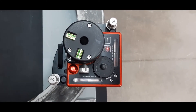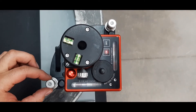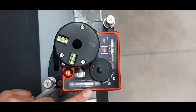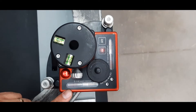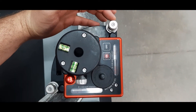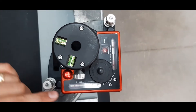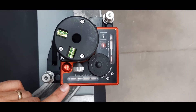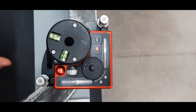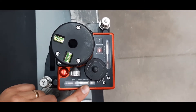If we look at the top of the D22, you can see it has very accurate spirit levels in both planes. The adjustment knob down here has fine adjustment, lower down is coarse adjustment, and the locking knob. This will adjust the laser coming out of the turret in one plane, and the knob on the other side with fine and coarse adjustment will adjust the spirit level in the other plane. We can use these to reference based on level, but for flatness only, it's not important to get the spirit levels centered.